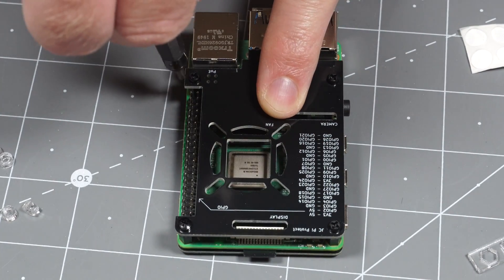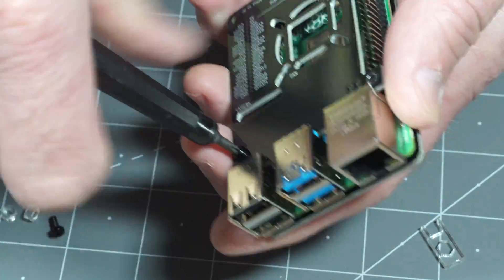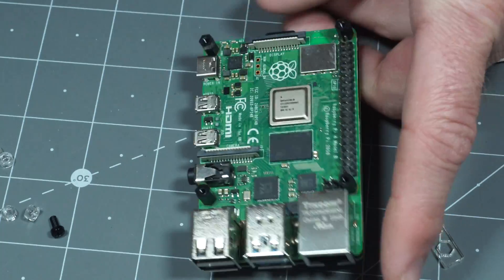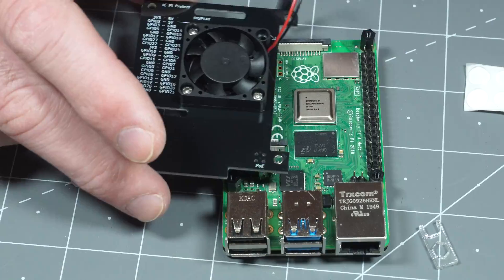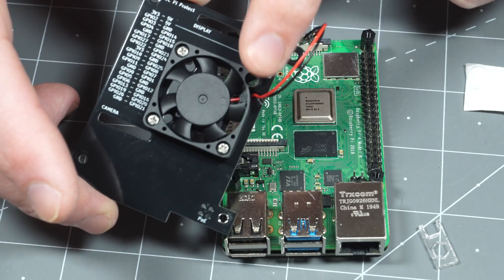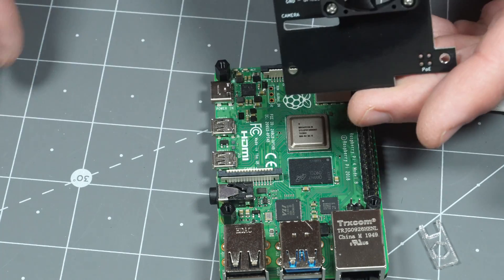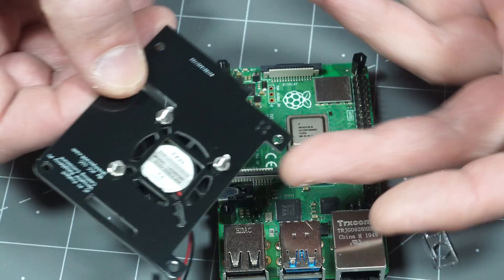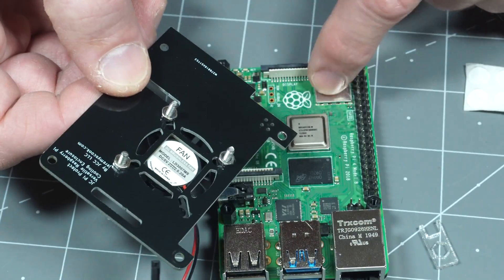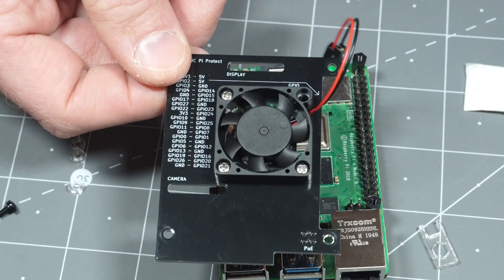So to swap this out, all you need to do is just take out the screws on the top. Then just put the breadboard cover back in here and screw it back in. Presuming that you'd like a fan on it, the standard 30 millimeter fan I've been using — if you put all the screws in the normal orientation, this fan will hit this module. So I've been either leaving these out, or you can use four spacers on that. Or alternatively, you could flip it over, but then it's just sucking instead of pushing. As you can see, you can just use three and it'll avoid that. In this procedure, I'm going to show how to do it with the spacers, so you can just lift it up a little bit. Whichever way you want to go is fine.